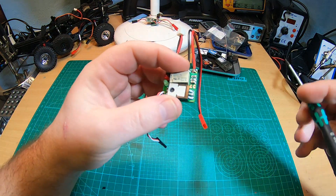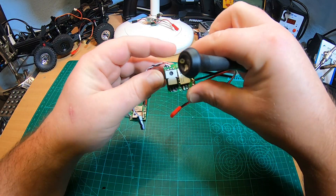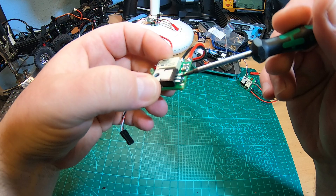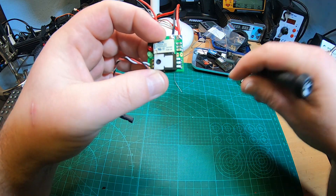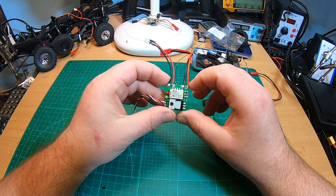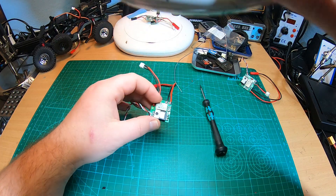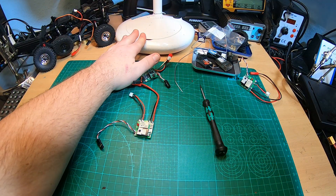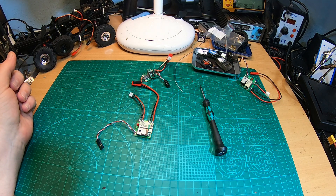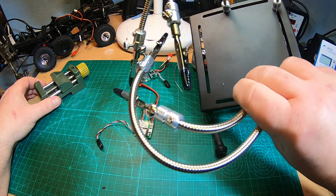That's the second one. When you saw it on camera, I bent and cut the BEC legs to solder them to the board — but I didn't have to do that. It worked the way I did it in the second ESC: I bent the pins on the broader sides and then everything worked perfectly. Soldering was really no problem at all. Most of you with a little experience in soldering will be able to do this with ease. With the camera it wasn't easy, but for the second one I simply used my loupe. If you have very good sight, maybe you could even do it without a loupe.